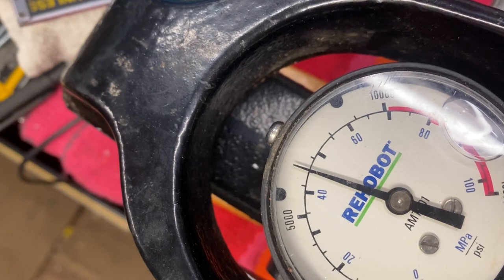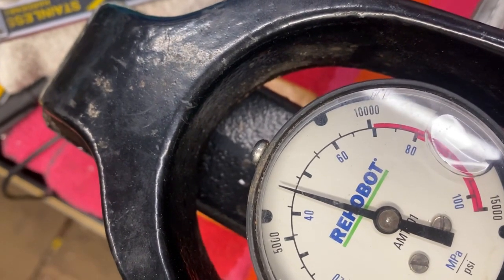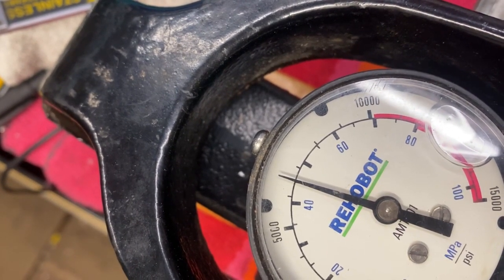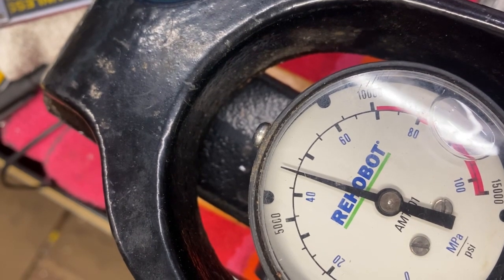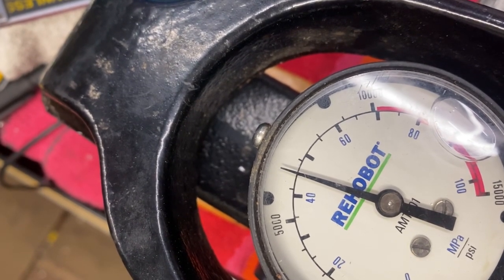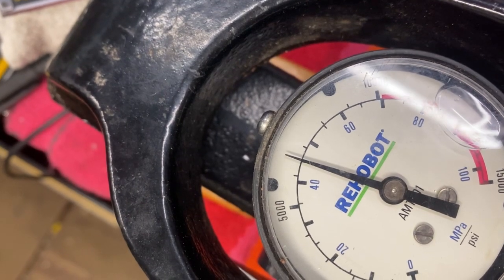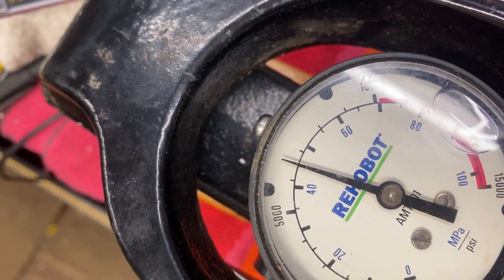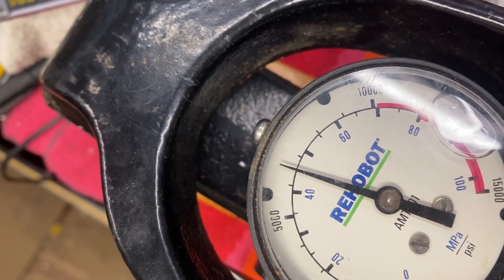Still dropping slightly. Not much, but dropping. There's no more water in there, so it's not leaking out. Might be the pump. Might be the cylinder yielding. Might be the alignment of the planets. It could be a million things. Most likely the pump leaking or the cylinder yielding or something else leaking. Yeah, I think I'm going to give it 4 minutes more, then it's 10 minutes, and we can call it good.